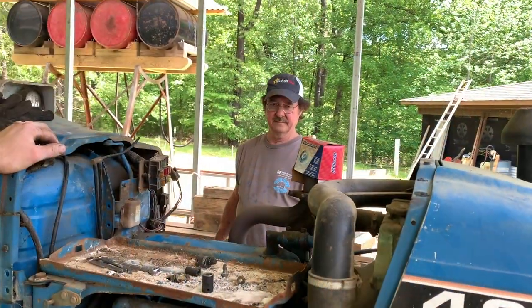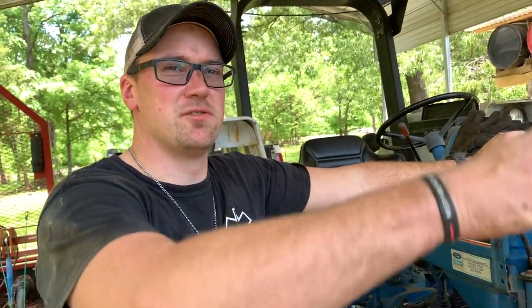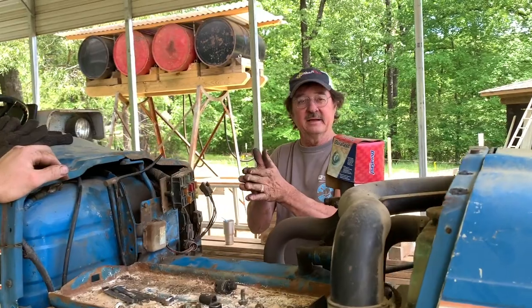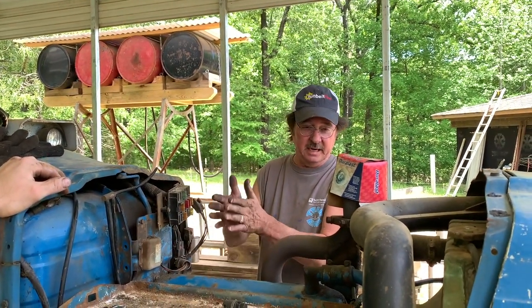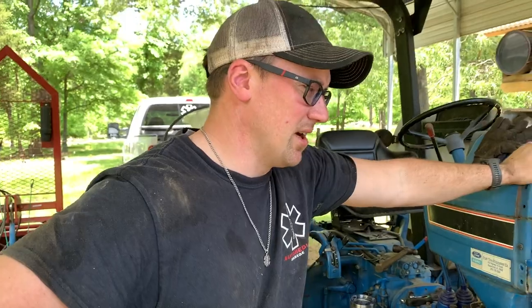Any problem Parker had with his? No, I think Parker's clutch material is worn. It's grabbing. You take his tractor, it'll drive through everything in his way right now. It just won't stop. What's happening is when you push in on the clutch with your foot, I think the bearing that everything rides on is stuck. And I hope we're going to see something really ate up or a spring's missing.